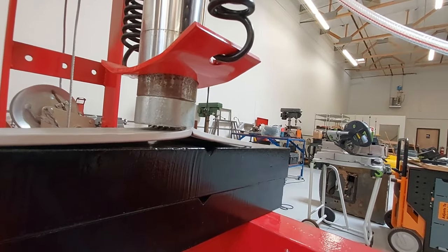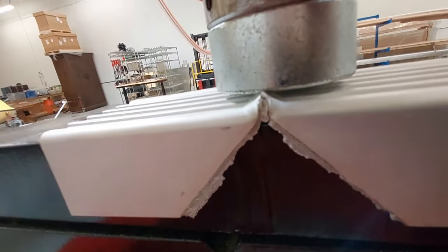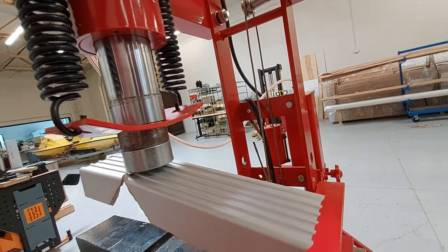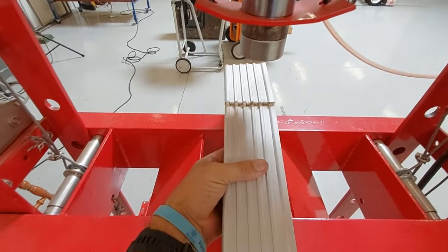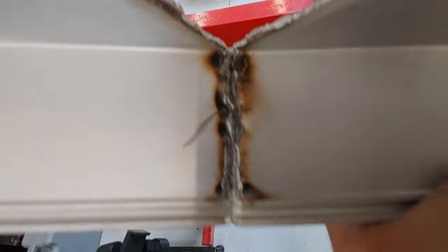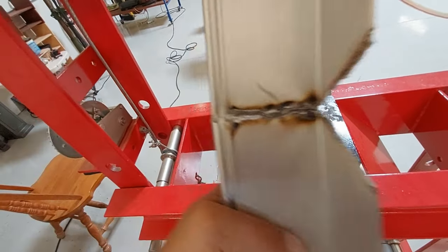Going back to fast mode — okay, we pretty much flattened that out. It's picking up the whole extrusion. We have to manually remove that. You can see those welds didn't break whatsoever — we actually had incredible penetration on that corner and the inside. It completely flattened itself back out and that weld did not break.